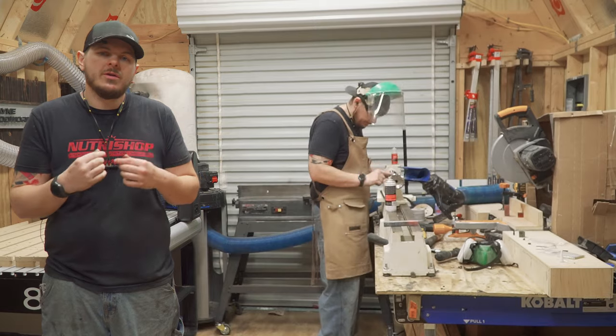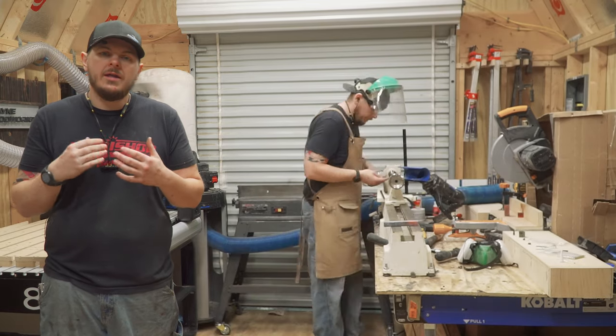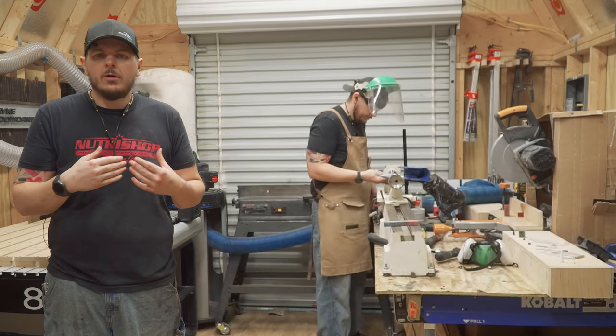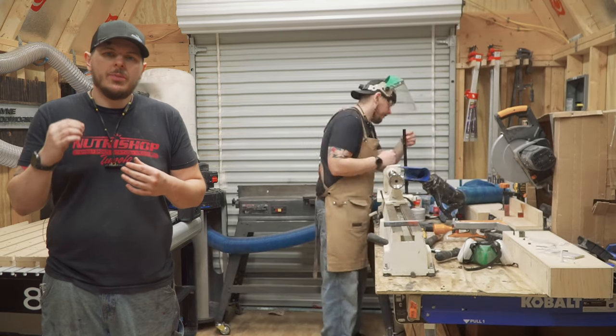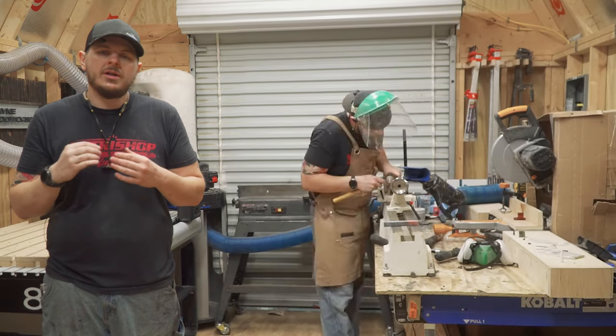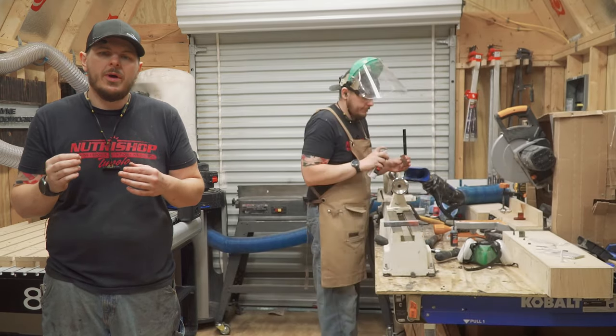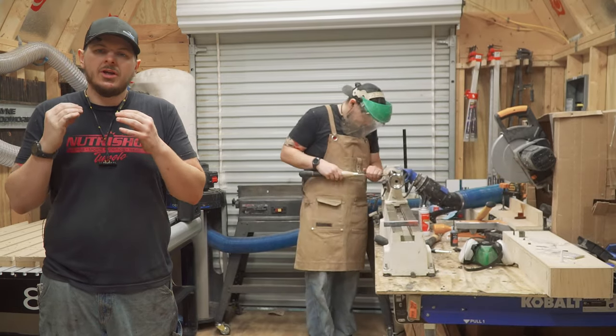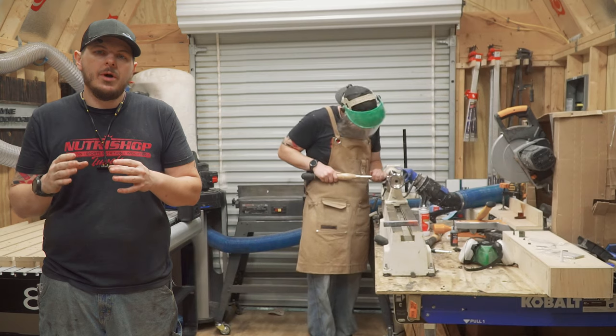That being said, when you're turning on the lathe, if you're using a carbide lathe tool, like what I'm using here from Rockler, make sure you have a nice sharp edge out front to give you a super clean cut. And don't try to get too aggressive. Make lighter cuts in multiple passes, and it will chew through the epoxy super fast.